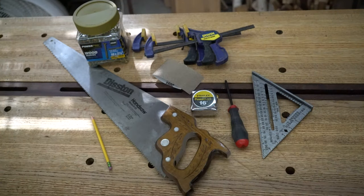These are the most basic tools you could build this bench with: a handsaw, a screwdriver, a pencil, a tape measure. Clamps are really useful — I'd recommend getting them. A carpenter square, some sandpaper, and screws. Literally that's all you need to build this, but you'll wear your arms out and it won't be easy.